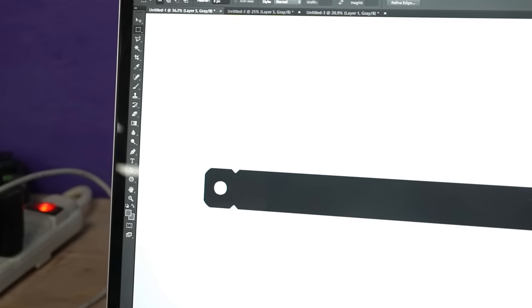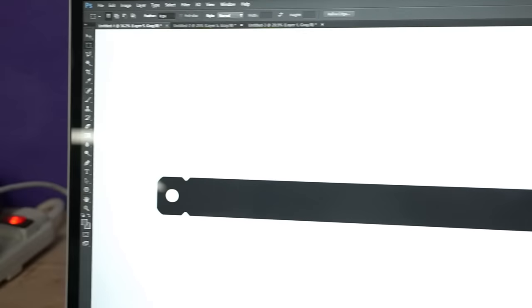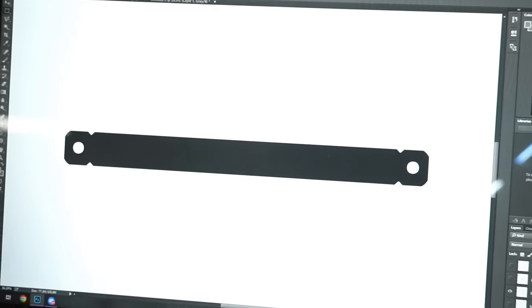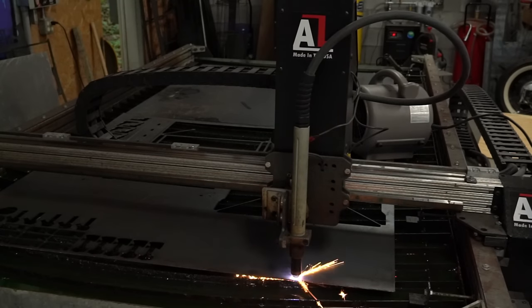So it's time to make some of the accompanying hardware for the hinge so it can mount permanently on the underside of the lid. So it's back over to design another piece and then cut it out with a plasma cutter. And what I do a lot in my program, I design little notches in my design on either side so I know exactly where I'm gonna put my bends on both sides.